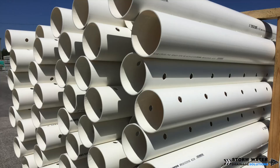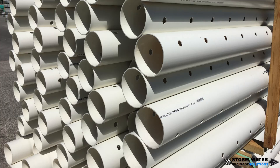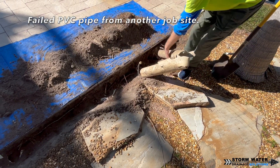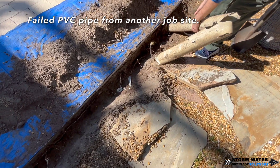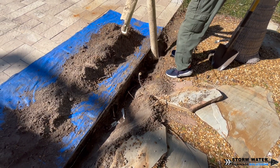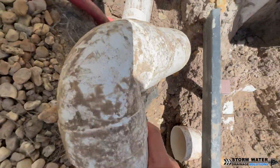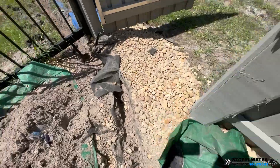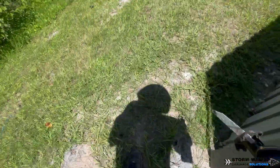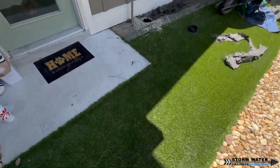Now you're only collecting water from two holes on either side. You can't put holes around the entire pipe because the pipe is so rigid and strong that if you put too many holes in it, it will crack, fracture, and break — it has no flexibility and no give to it. So PVC pipe with perforations is ideal for leach field applications, using it to leach water out of those holes in a controlled setting. That is the best application for perforated PVC pipe. Perforated PVC pipe is not good for collecting water — it does not have enough inlet to collect water efficiently.